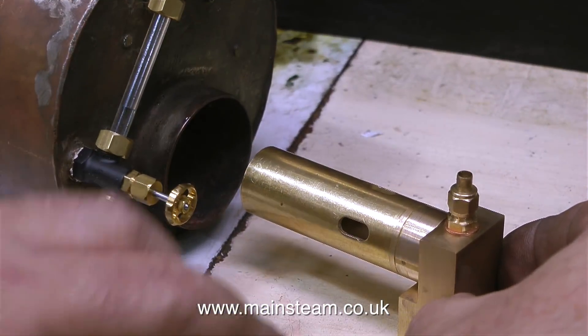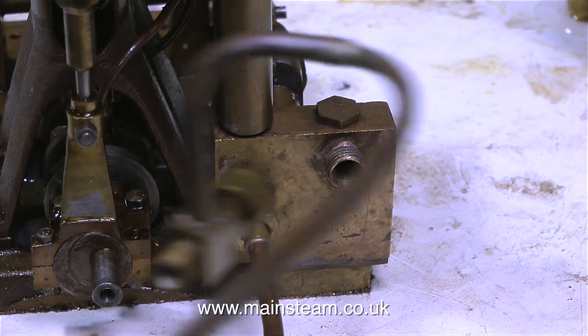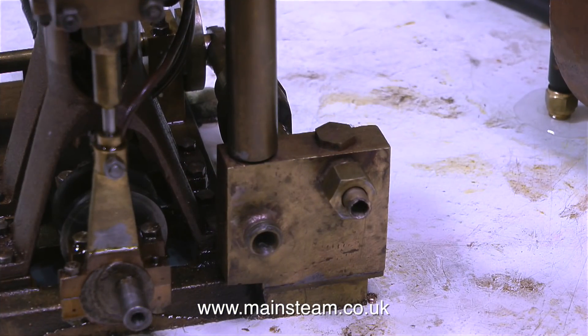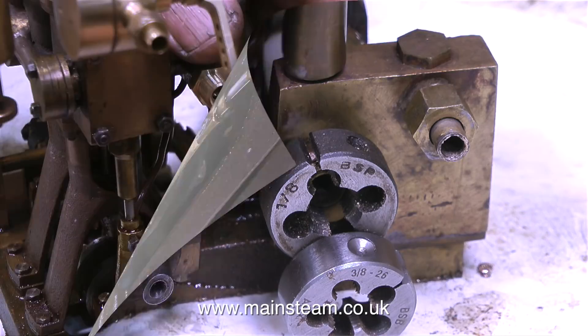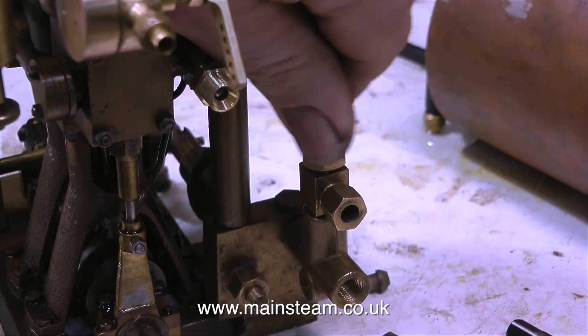Here's the finished burner with its mounting that will need to bolt into a metal plate which goes underneath the boiler. The steam engine is fitted with a water pump and these are the connections that go from the tank to the boiler — the bottom fitting is the water inlet and the top fitting is the water outlet. I'm trying some of the original piping in place to find out what the threads are, and I soon found out that these were not ME or model engineering threads — these are commercial pipe fitting threads. I found out by using a die that this one is a 1/8th BSP. It's always puzzled me what the 1/8th part of this means because the hole in the centre of this fitting is not 1/8th, but I do think that on a general commercial steam fitting the hole in the centre of a 1/8th BSP threaded piece of metal is generally 1/8th of an inch. Any experts out there I'm sure will tell me if I'm wrong.